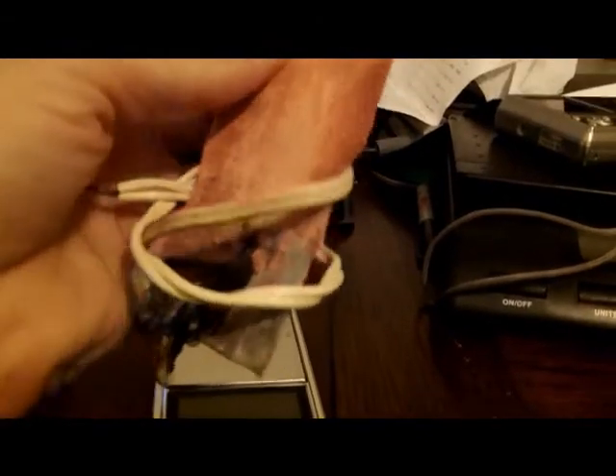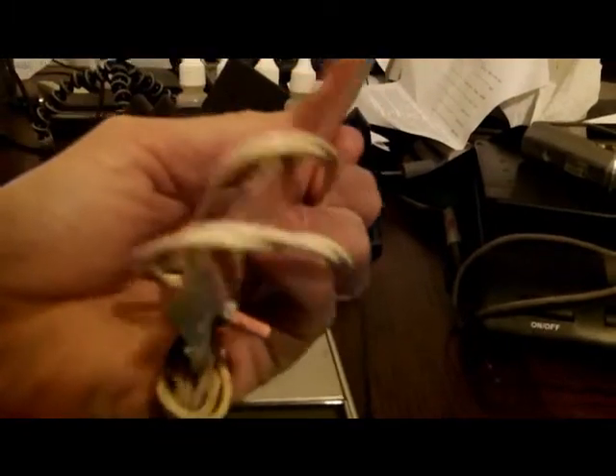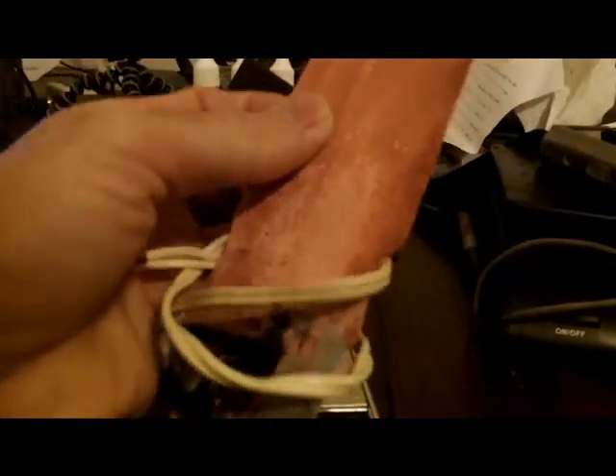The slower rate seemed to help coat a smoother layer, even on the front side. The only rough areas are over on the edges of the front and the very edges of the metal. As I redesign the cathode, I'm going to take these observations into account to build a better surface to deposit copper on. One thing: maybe start with a lower voltage, and also look into using a physical barrier to slow the rate of copper plating down a little bit to get a smoother result.